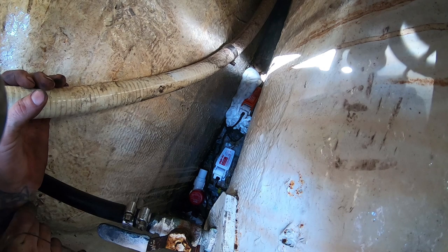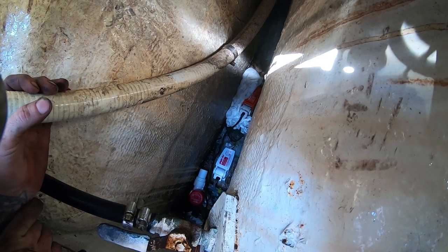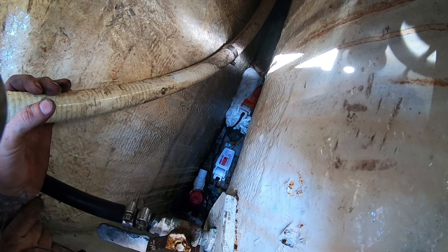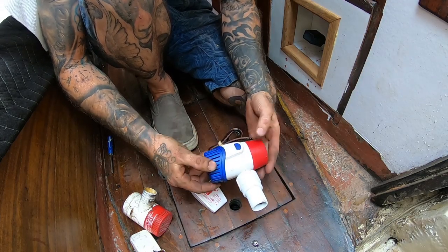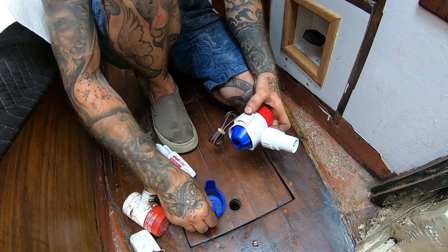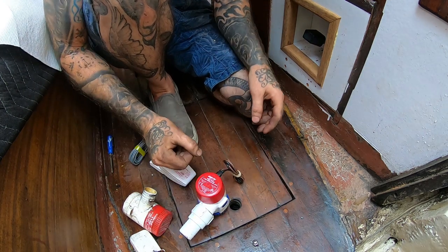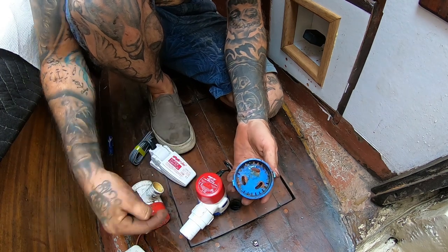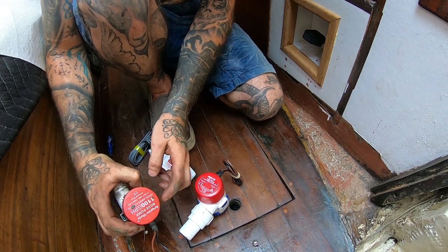I might scoot the super switch back just a hair once I undo those wires, tucked in a little tighter to the pump — but I don't want to interfere with water intrusion into the pump. This pump won't burn out if it runs dry, which is good. Here's how it works: you screw the base down into these, then you reach down with your wired-up pump and snap it into place. These little plastic snap pieces are what broke off on the old pump and got sucked up, stopping it from working.